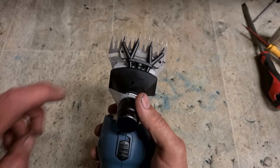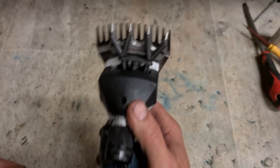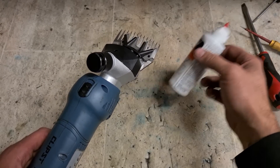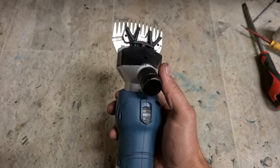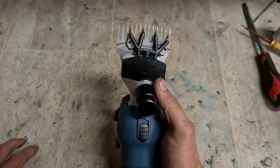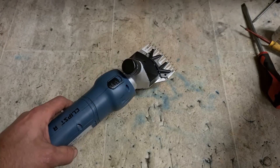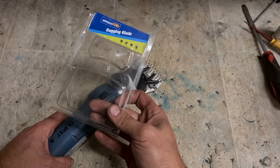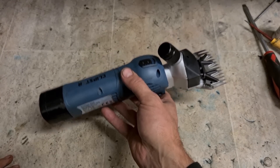To keep them good, just care for them a wee bit. Keep an eye on your blades — make sure they're set up right. Don't be letting them get too rusted. Use a bit of liquid oil on them as well to keep them lubricated. If they are cutting badly, don't just keep tightening the blade set-up. You can get these sharpened up, or you can buy replacement blades. The sharper the cutter, the easier it is on the tool.